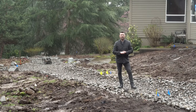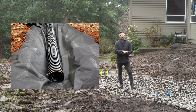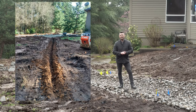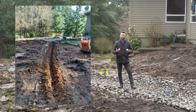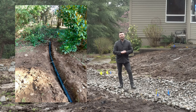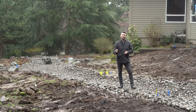Underneath these dry creek beds are French drains. French drains are wonderful at moving water — we use a three inch perforated pipe. You put that into the lowest part of your drain, and water will always seek its lowest point, so you just make that perforated pipe the lowest point. Once you have that, you can mask it, but it captures the water and moves it from one place to another.